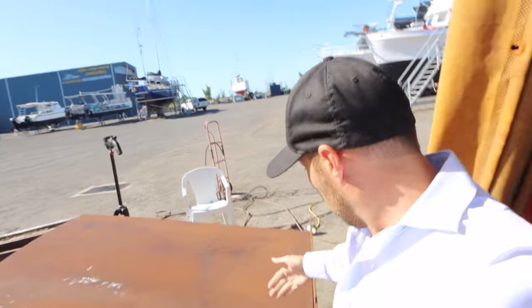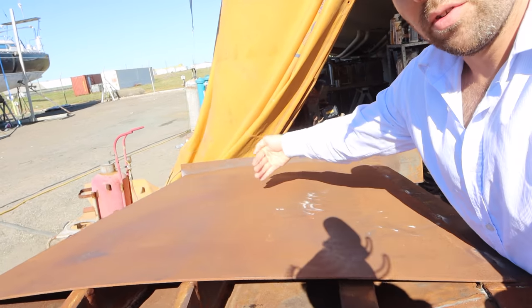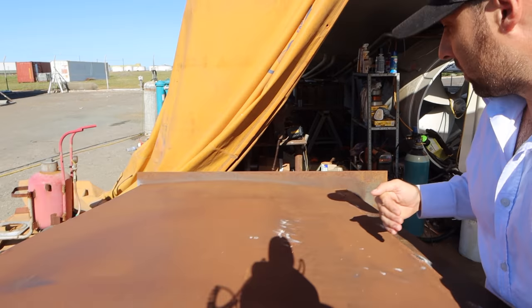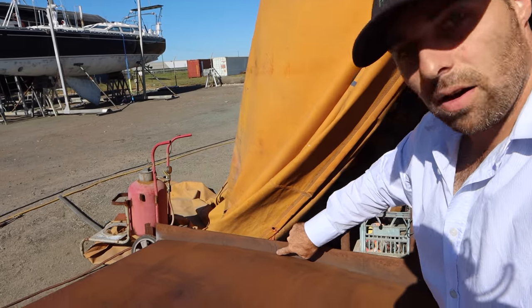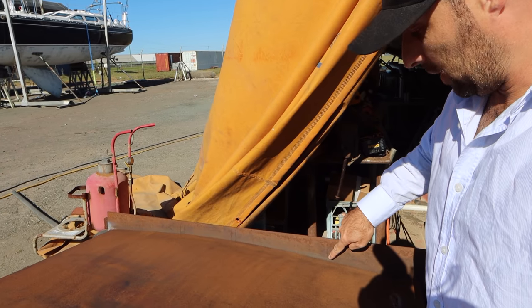First thing in the morning, we're going back down, get these skins sorted. So we've got a quarter of our skins on. Two skins per wing, one wing half done. So what I've got to do now is go through and, if I show you that way, where these ribs line up down the skin here, I've got a little mark on this side just here. So one there, and then one here for the 50 mil piece.